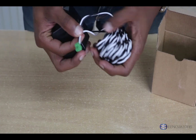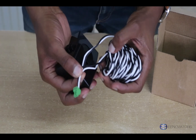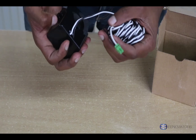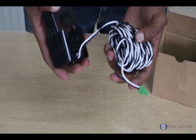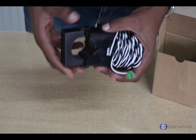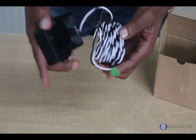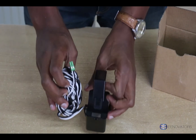At the very end of the cable it has a termination which connects to your energy meter. In this case, this is the energy meter that will be connected to this current transformer. The current transformer will only measure current for one conductor, so if it's in a three-phase system you will need three of these. That's it for this unboxing — thank you.